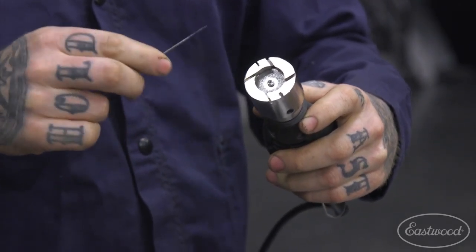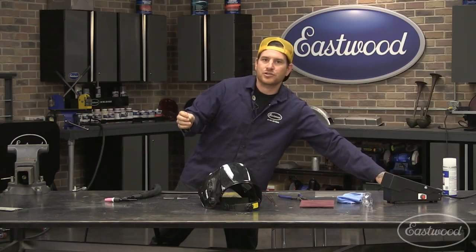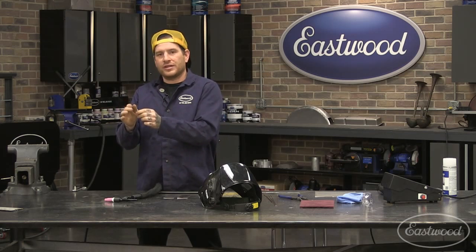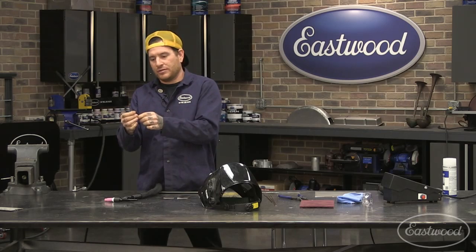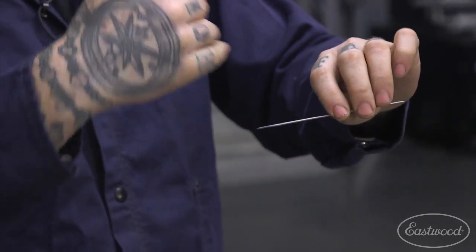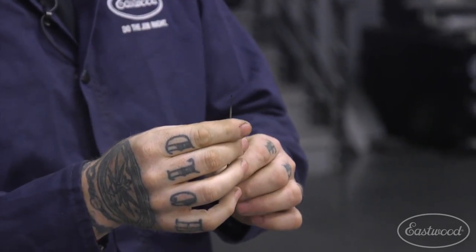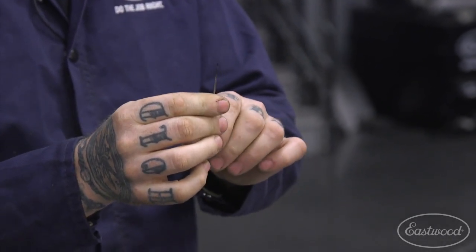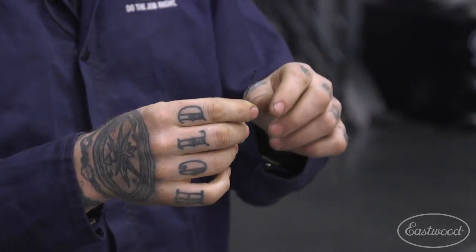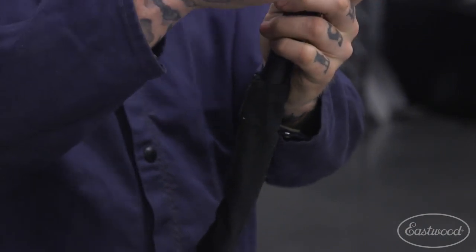It's really nice. Now, if you don't have one of these and you're just starting out, you can use a belt sander or a bench grinder. Just make sure that the direction you're holding the tungsten is the direction that the belt is spinning. If you spin it crossways, it will put scratches or sanding marks the opposite way, and you will get a turbulent arc coming out of that. So if not, just grab a tungsten grinder. It makes it a lot easier. You can do it right on the bench. You don't have to walk over somewhere else to grind your tungsten. So that is the tungsten. Here we have our gas nozzle.